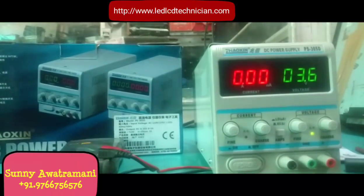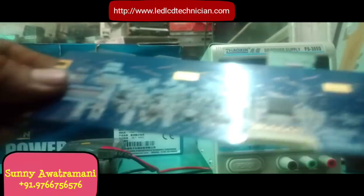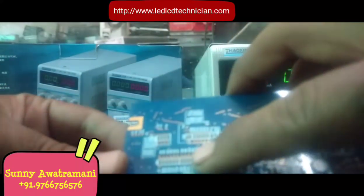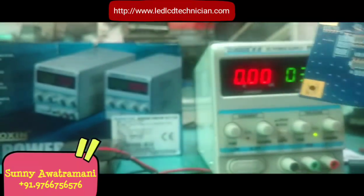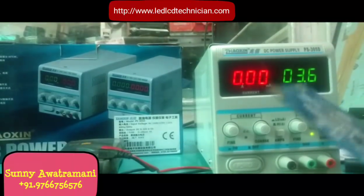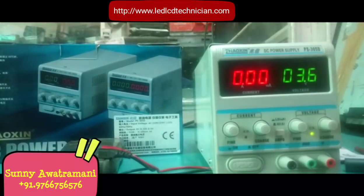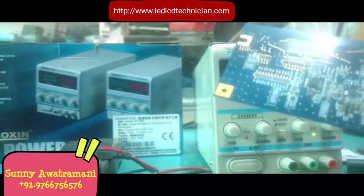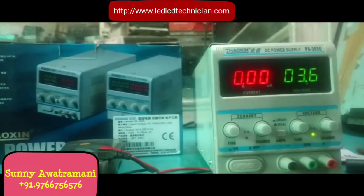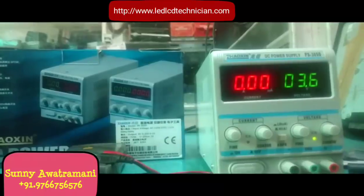Some boards have a scaler PCB. On the scaler PCB, there are small capacitors which are commonly shorted — on the AVDD line, AVGL, and VGH line. We don't know if the problem is from the IC or a shorted capacitor. For example, if AVDD should be 15V but you don't have 15V — if there is a shorted capacitor or IC short — in this condition you can apply AVDD 15V externally. If it's a capacitor short, the short will be clear and you will know what the problem is.